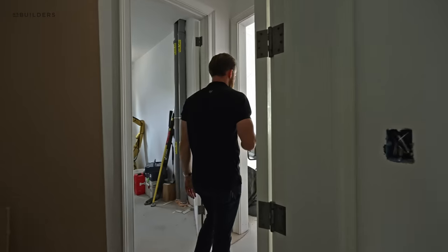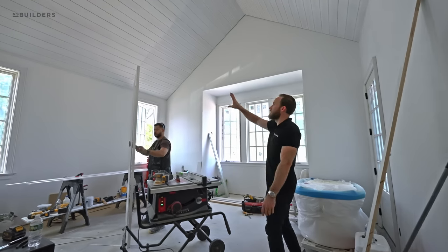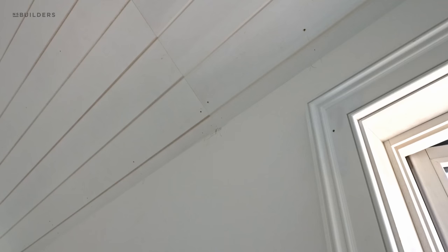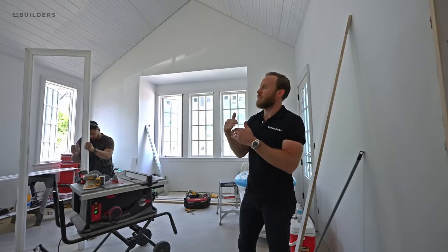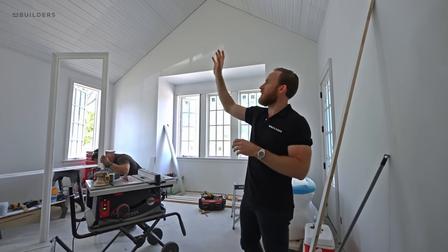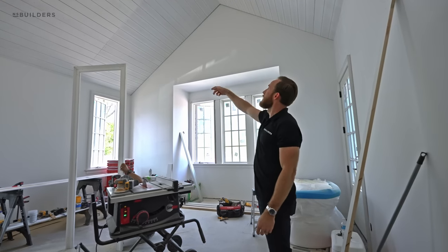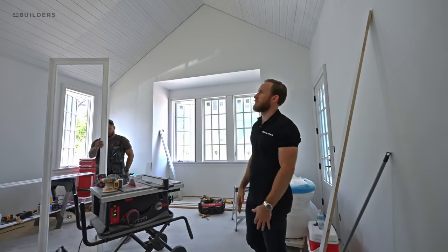In the primary suite, this is one of the areas with a V-groove ceiling. If you look up, you can see this eight-foot panel with a seam in the middle and then a four-foot section going into the wall. Against the wall you have those gaps and that seam — obviously not the final condition. We actually have a very low-profile beam detail, only about five-quarters of an inch with a profile on either side, which will tuck against the wall and cover that seam in the middle. Once it's all painted it'll look really nice.